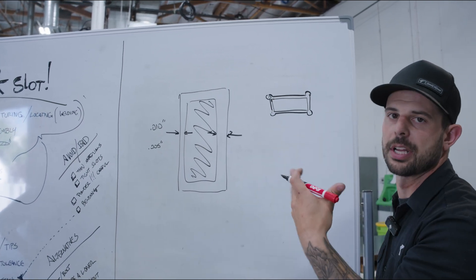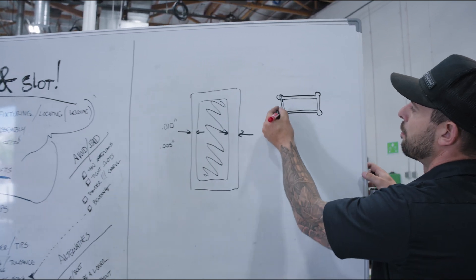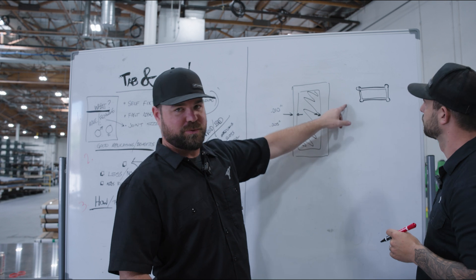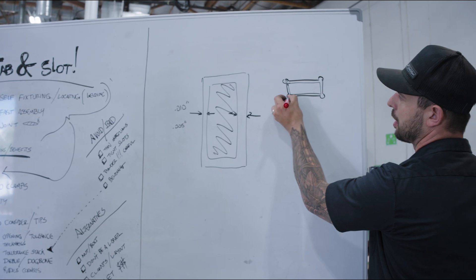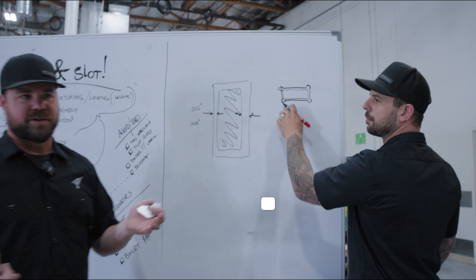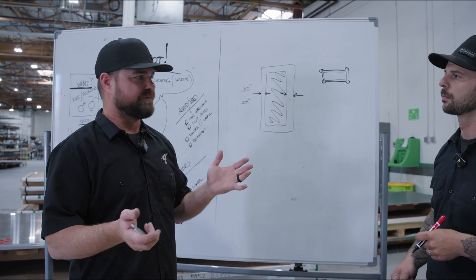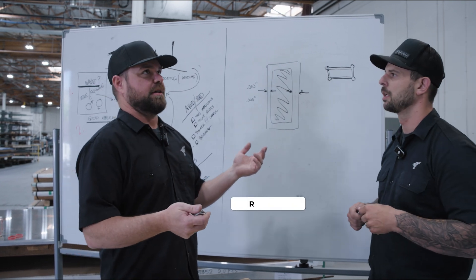This is really good if you want your part oriented correctly. It's especially critical in materials cut on CNC routers because there you have a tooling radius. The router comes in and opens up that corner, allowing you to have essentially a square corner without having one. On laser, our beam diameter is usually six to eight thousandths, so the radius of the beam is almost non-existent. But on a CNC router, typically we're going to have a radius of about sixty-three thousandths — we use about an eighth-inch bit on those materials.